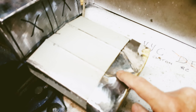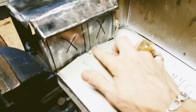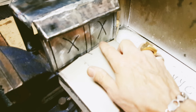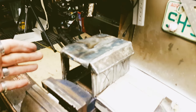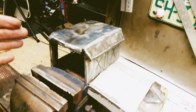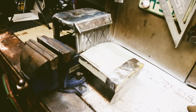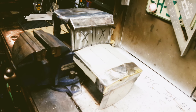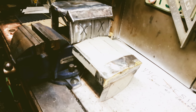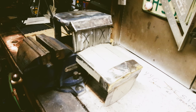I've got the rad support and hood all formed out with the body lines. Where these X's are will be the windows — the left and right windshield pillar and the center pillar, because it had two windows, not a single windshield. Then we will continue on and put a small sleeper on the truck and of course the big back box of the wrecker. This is how far I've gotten so far, and I'm going to start making the doors and the side rad support pieces and get those welded on.